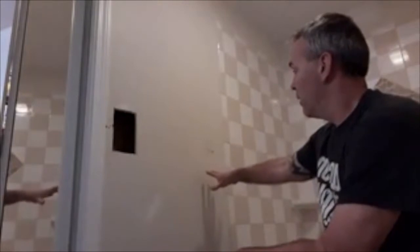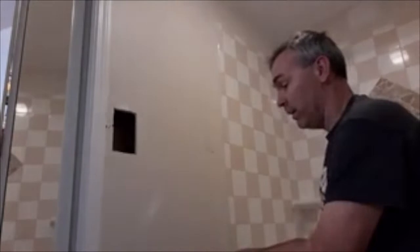Okay, so during the tearing stuff apart, I've figured out that my new towel bar won't work with the same holes, and I'm going to be installing a double towel bar. So it's going to be holding two towels, which is a lot of weight. So I cut a hole in the drywall and I'm going to add a block of wood in there. I'm taking this opportunity to show it's another easy way to see how we can patch a hole in drywall.